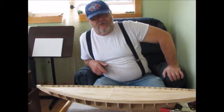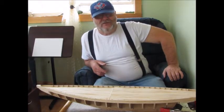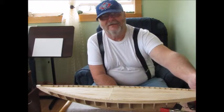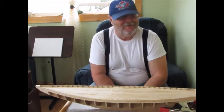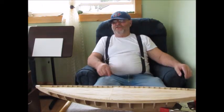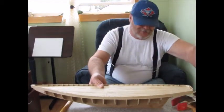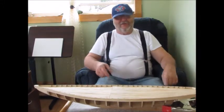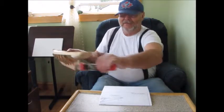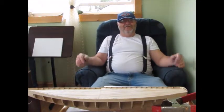The most important caution I give myself is: don't use a lot of clamping pressure. I had a hard time getting the back transom on, and I wanted to get it done in one step, so I decided to use spring clamps — not that big, but still a pretty strong clamp. So I had it all together, going around that back rail.